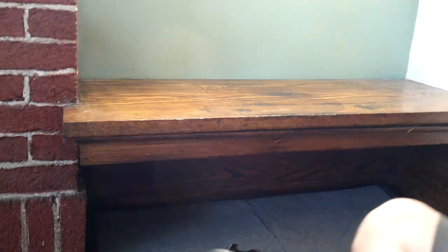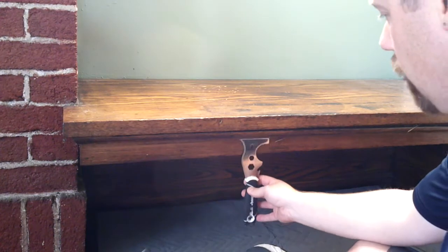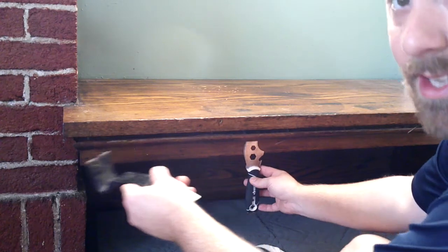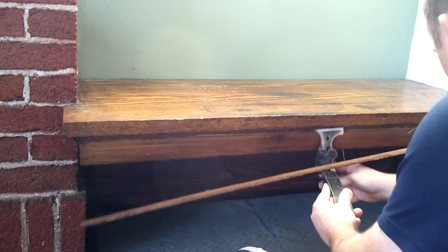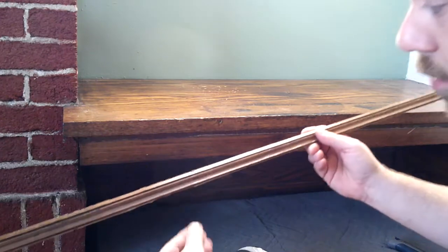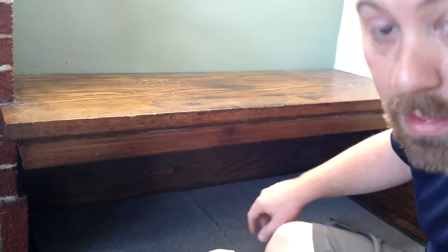With a little bit of time and patience you can get moldings off wood without breaking them. I've been using a combination of this 501 tool and this little mini pry bar — you just kind of go right behind it, and as you get more exposure just lightly press it back and forth. You can see that side just broke free. I have one more nail right here — and that is how you take off probably 100-year-old detail molding without breaking any of it.